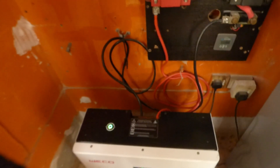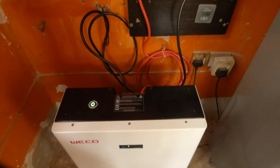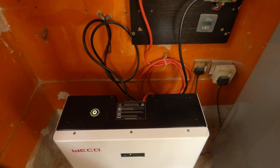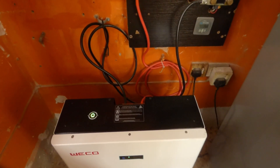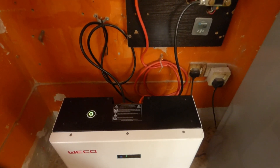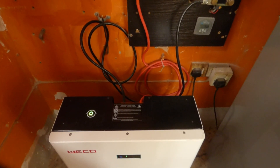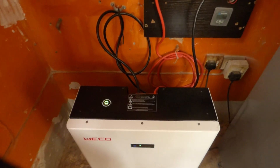And here are my batteries. Yesterday I pulled 82 out of 86 amp hours out of it. At 3 o'clock this morning power went out — it was my test to see how much I could pull out. So I pulled 82 out of 86 amp hours and it went off. Now I know how to manage it better and I should be able to run it through the night. As I progress, I'll do more videos and show you what I'm doing.